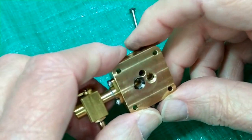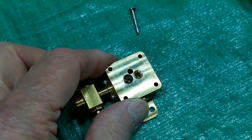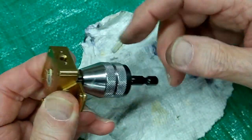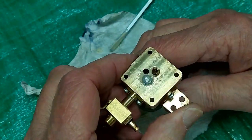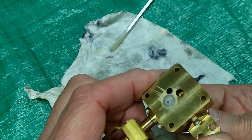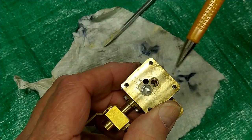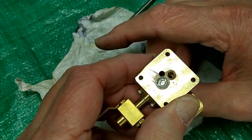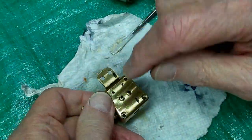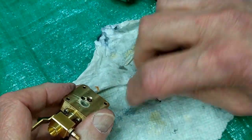I don't think we've done quite enough, so I'm going to switch to toothpaste. I didn't like the results with the toothpaste, so I went back to the metal polish. The chuck is hanging down here — just the weight of it hanging on there. Give it a little spin, pick it up, redistribute some of that polish. I know I'm doing some good because it's turning gray, picking up some oxide from the brass. Don't want to get too carried away. Put some ink back on there and look at it again.